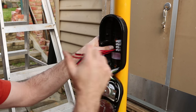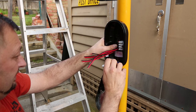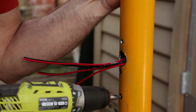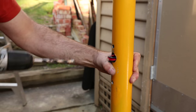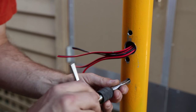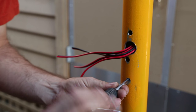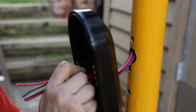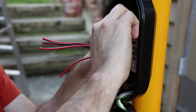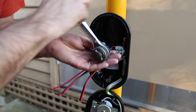Next was to actually fit the button to the pole, which meant a few more holes to drill. Whenever I was drilling holes, I always used a short stubby bit to make sure the holes were centered exactly where I needed them — using a long drill bit is not a good idea because it tends to wander all over the place and not end up in the right spot. The final stage was to get it firmly attached to the pole and make sure the bolts held it tight. The pole is actually smaller than the original pole it's intended for, but it seemed to work quite well.